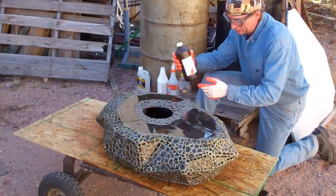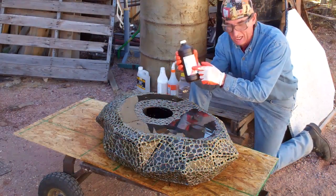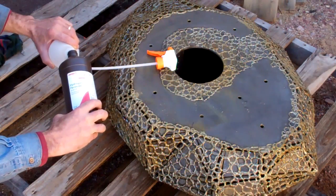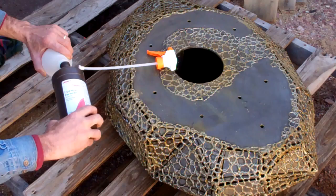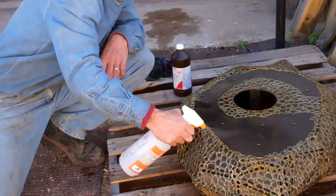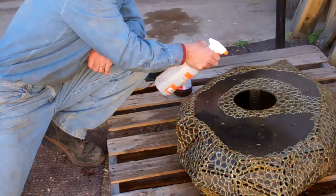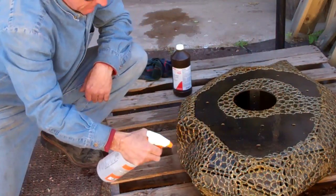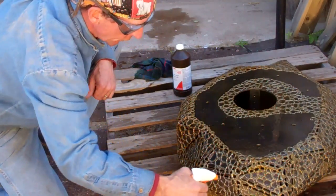Which, as soon as this dries, will allow this hydrogen peroxide to go to work and activate the rusting process. So now that we've thoroughly cleaned out our spray bottle, we're just going to fill it with straight hydrogen peroxide and spray it on. We'll do this a couple times over the next couple hours — you'll start to see that rust work here real quick.